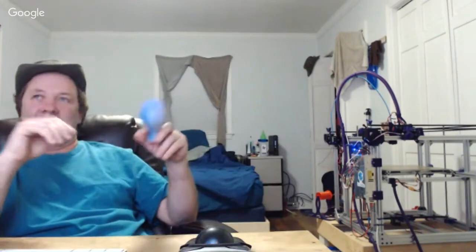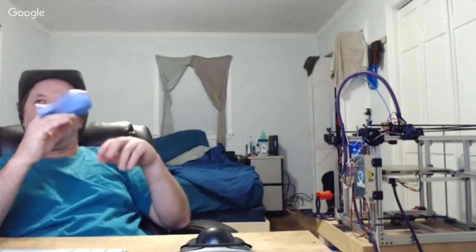You know, I'm thinking I'm going to release the files for this printer finally, but I'm going to do it in weird parts and just say, look, the parts that don't work, like the bed motion system, is not good. It's terrible. I've got it working and smoothed out, but I would not subject that to anybody. But the upper systems, the belt path, the motor stands, the towers on the X brackets, all that stuff are really well done now. Got all the issues ironed out and they work very well. So I'm almost thinking of releasing that and saying this is something you could add to something with a good bed movement.